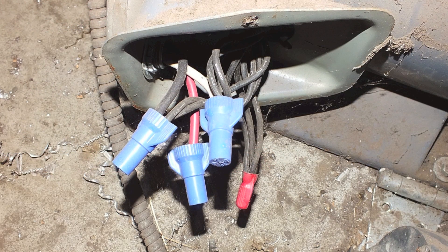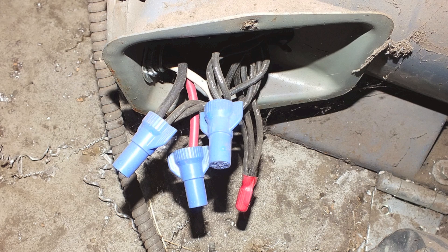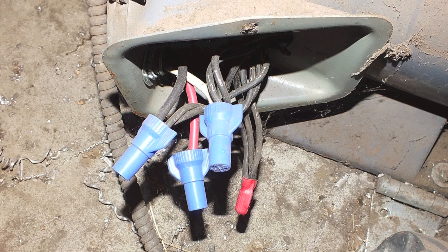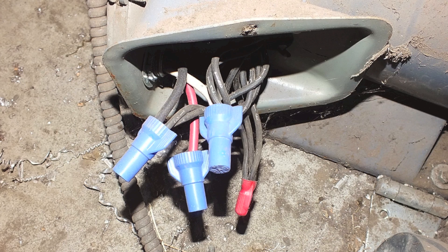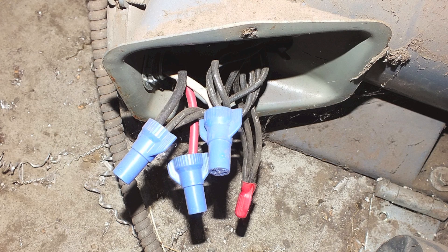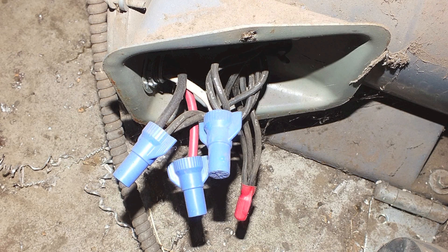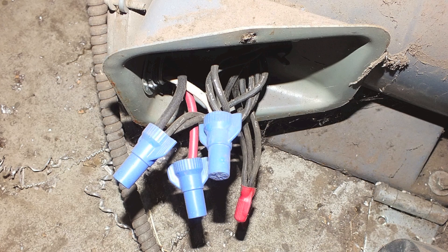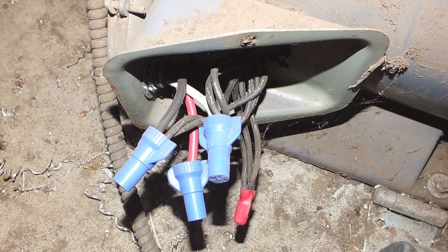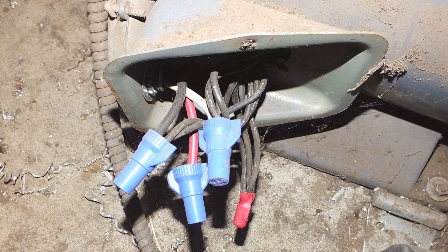Here's a picture of the cover of the motor off where all the wires are connected. You can see the top one with T3 has got black - that's going to the other motor. You've got a white one going into T2 and T8, that's going to the other motor. And you've got a red one down below. Those three blue wire nuts are your connections. All you have to do is take a wire from each of those blue wire nuts, which was originally the power coming into the motor, and simply run it to the other motor. Then run your single phase power into the first motor.